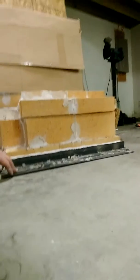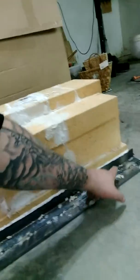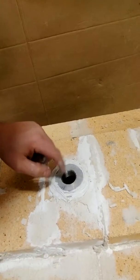So what we got here on the bottom is 1/4-inch plate, 2 feet by 2 feet, and then I took 1/8 inch angle iron to make a square box to help lock the bricks in. This silicone tube sealant that you see going around in spots here is actually a glue. I did that just because I had stuff left in the tube. I mostly bought it because I punched too big of a hole for the actual end of the burner of Alec's. So I'm letting that cure. I'm hoping in the near future I'll be able to get it mounted up on the stand and fire it up and start working. Hopefully make my first pair of tongs so I can start doing some other cool stuff.